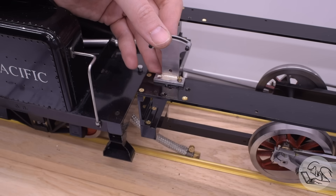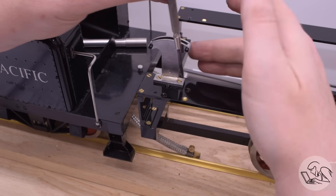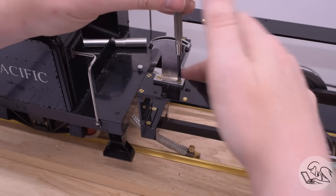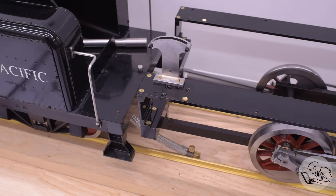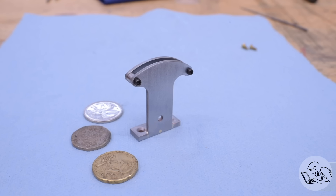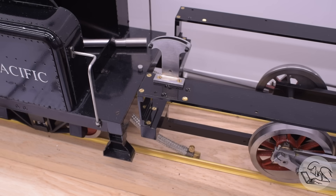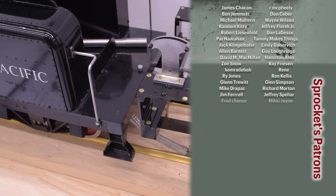The eagle-eyed among you will have noticed that I've swapped the two top pieces around — I actually installed them backwards in the previous footage, so that's been corrected. Now you can see kind of where this goes on the footboard — that'll be the back area of the cab right on the end of the boiler. You can also see where the reversing lever will go down through, pivoting on that hole, and there's a cutout in the footboard which gives clearance for that lever to move back and forth and connect to the reach rods which will eventually go forward to that valve gear. Yes, it is supposed to be asymmetrical — you have fewer notches on the reverse side than on the forward side of that quadrant. More on that later when we get to the final notch cutting. Thank you so much for watching, and thanks to my patrons for making all of this content happen — I'll see you next time.